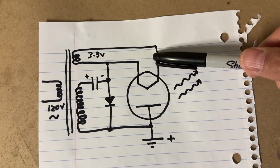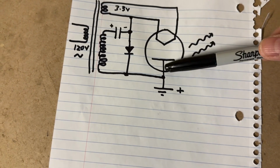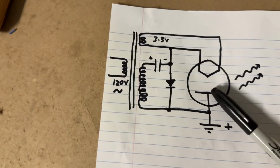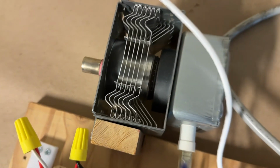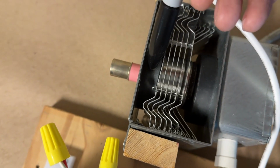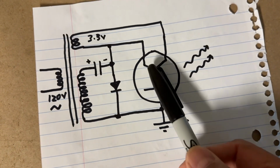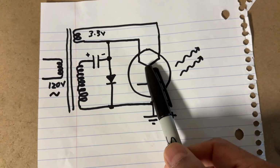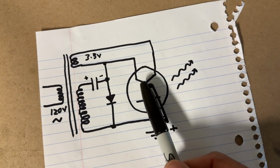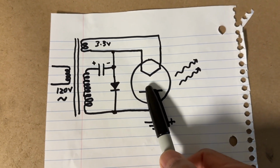And so at 4,000 volts, electrons flow from the cathode to the anode through a certain size diameter chamber. It's a metal chamber, and it's been cut to exact dimensions. And the two opposing ceramic magnets on either side cause the electrons, instead of traveling in straight lines from the cathode to the anode, to start traveling in a circular spiral type motion. Depending on the voltage, the velocity of motion changes.